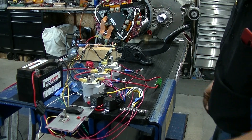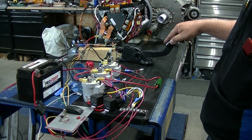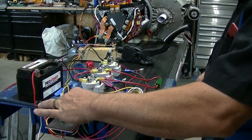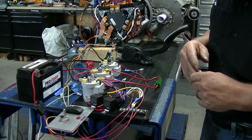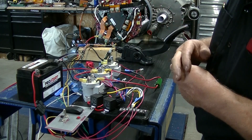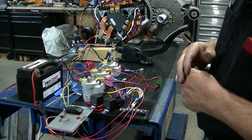So that's forward, and now I'll hit reverse — and it stops. There's reverse and it should go the other way, which it does. So that's forward and reverse, and I have it set up on really low power. I have it set up on really low power because when you do these tests you don't need 400 volts. I only have it running at about 57 volts. I have 12 batteries to set this up with — I'll have a 2P 6S battery pack so it'll be right around 400 volts and really powerful. It should be able to run this performance motor pretty nicely.